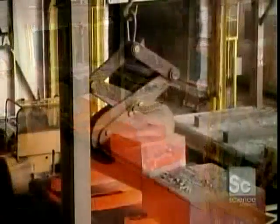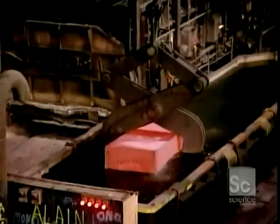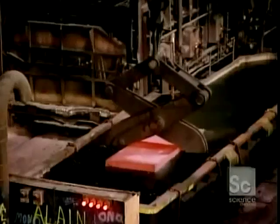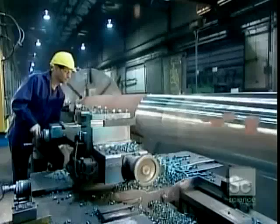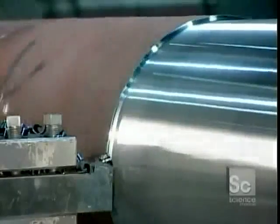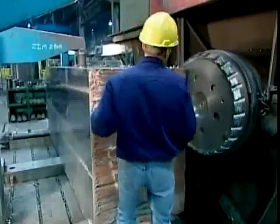They heat for a day or two depending on the grade of steel. Then they soak in a water and chemical bath for about 5 hours. This strengthens the steel even more. Finally, workers mount the steel forgings on lathes and milling machines. They remove the rust scales that form during heat treatment, then precision machine the forgings into what the client ordered. Usually industrial parts such as rotors, spindles, and shafts. Many factories prefer to buy forgings in the shape of blocks or bars and machine the parts themselves.